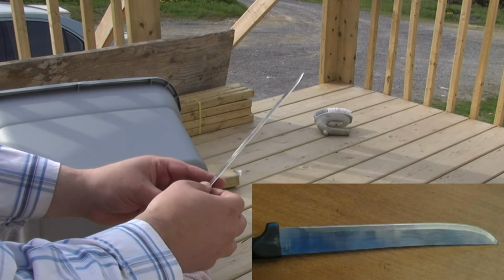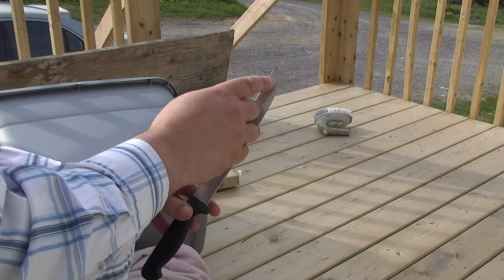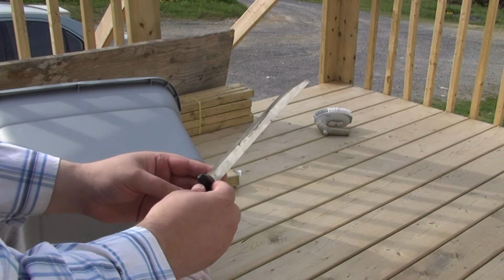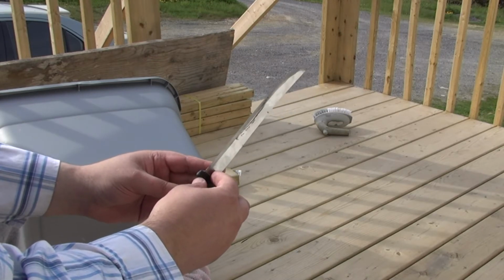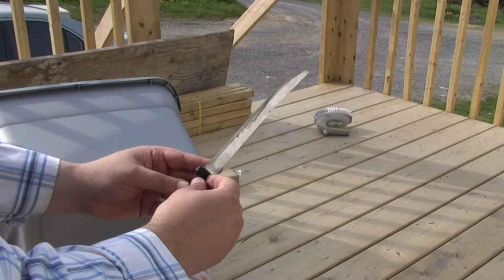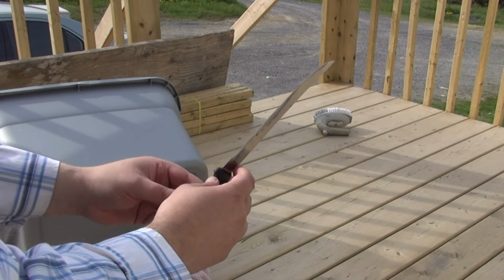The edge was also just left with the rough, very shaping grit. No attempt made to deburr it, and it was actually burnt blue-black through the tip. So I didn't have much of a positive outlook for the edge retention. It wasn't extremely sharp to begin with, and just had that rough, sawing effect, which it maintained for slightly more than a month.